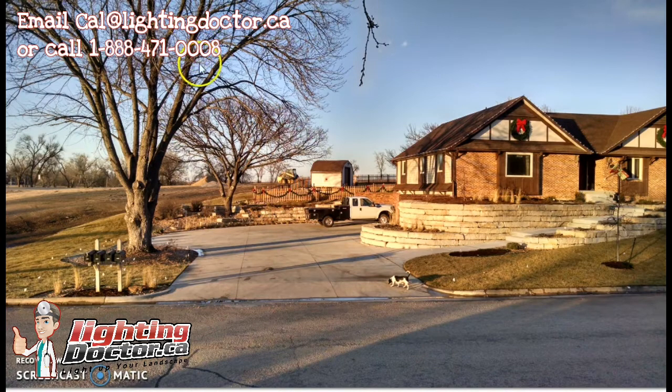Down lighting from the crooks still lights up a lot of the trunk and gives extra light below, and in winter when there are no leaves, the light shines through the branches creating really cool shadows year-round. You can use a hanging light, a dedicated down light, or even an accent light on a thicker branch using our special tree stakes, which are easy to mount. The tricky part is getting the wire up and ensuring it has room to grow with the tree, but there are tips to make that easier.